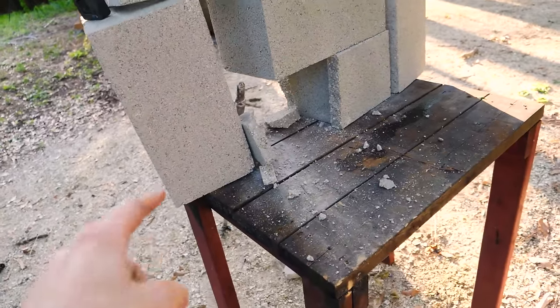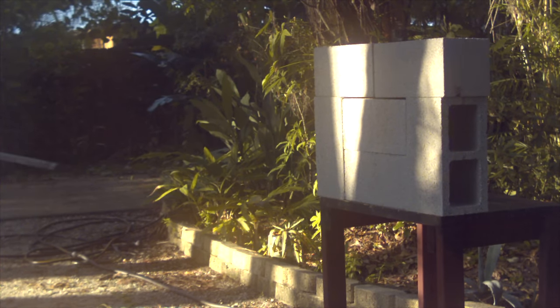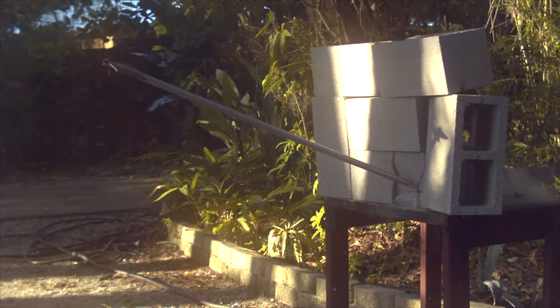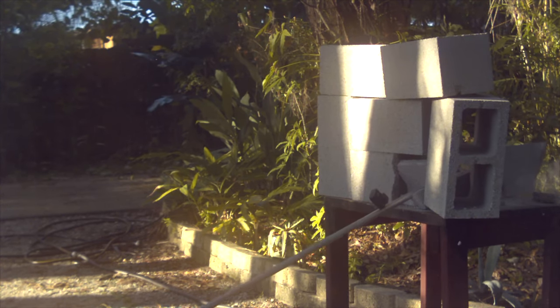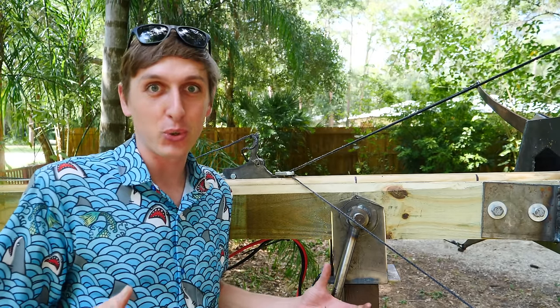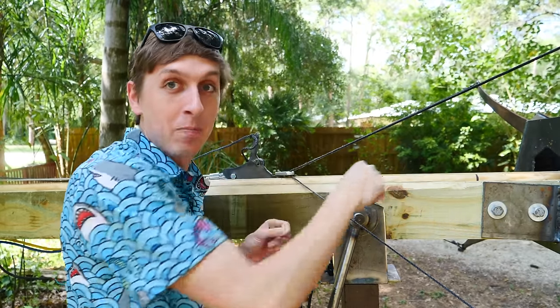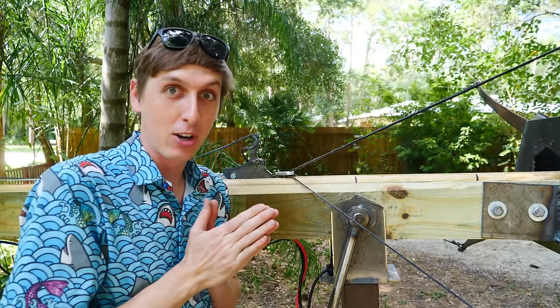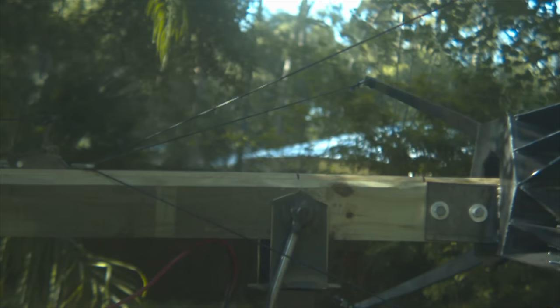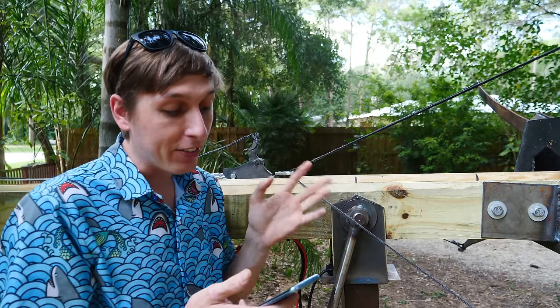Come look at this. There's just a trail of dust back there. I am shocked this thing is still standing — I can't believe it, by like a hair. It seriously just destroyed that cinder block. That's really impressive. And this is a heavy arrow — this thing must weigh 2 pounds easy. We've been shooting this scorpion and it seems really, really powerful, but how fast is it shooting exactly? I have two black marks here exactly one foot apart, so we're going to fire this thing in slow motion to see how fast it goes. Firing without an arrow, this thing crosses the two black lines in 10 frames, which means it's traveling at 150 feet per second. Now with an arrow on it, the speed is reduced to around 107 feet per second, which is about 75 miles per hour.